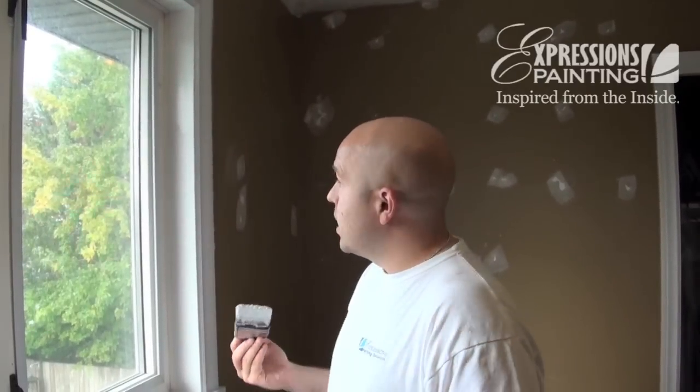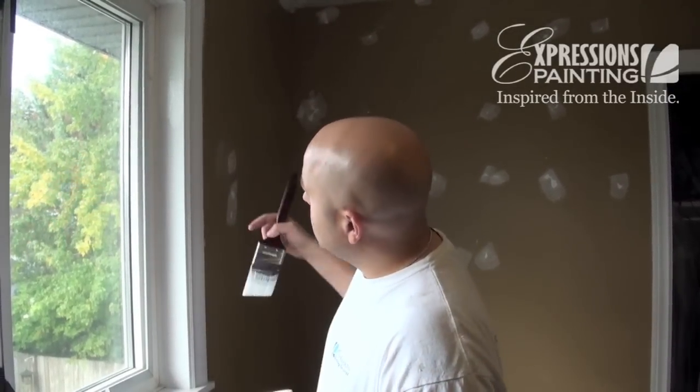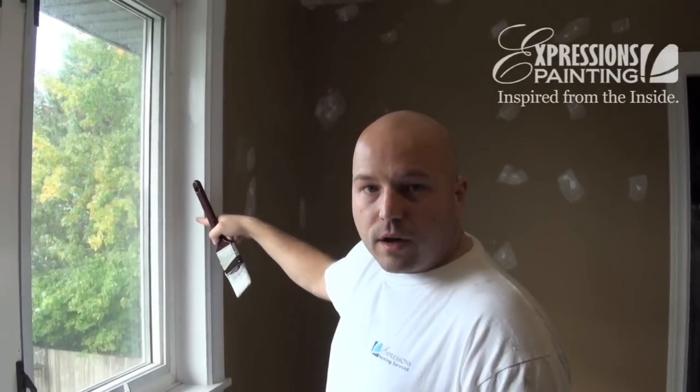To give you a point of reference, when you have a properly dipped brush, you can typically go maybe about a foot. In this width of a frame, that should give you a good guide as to how thick you should apply the paint.